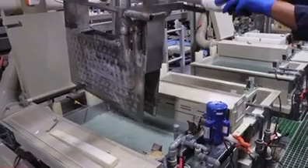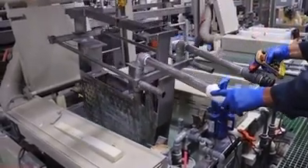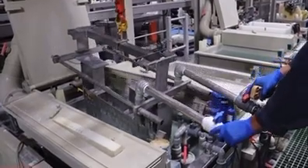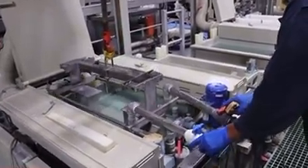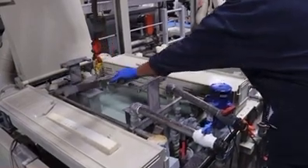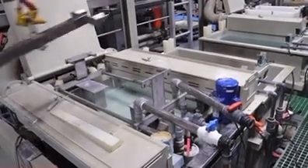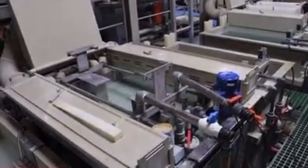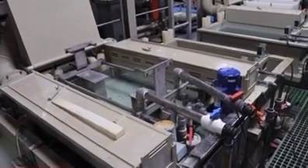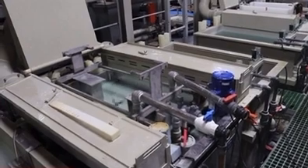We use plate coils that are electropolished and immerse them in this rack into the plating bath. Because they're vertical, nothing will settle on them. Once we move the hoist out of the way, we're going to connect a sump pump and two hoses to the input and output of the cooling coil.